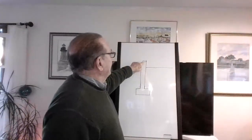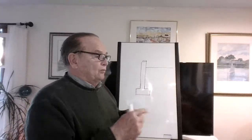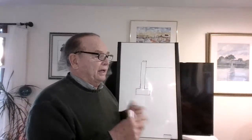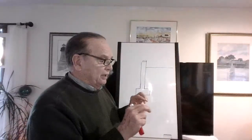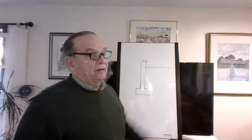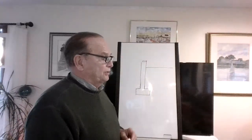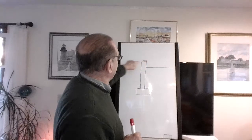Okay, and under it, this I'm sure you're all familiar with. It's called sill seal, SEAL. It's like a cushiony roll of, it's almost like a packing they use to pack stuff so it doesn't get damaged. For those of you not familiar with it, it's foam and it compresses, and it works really good. I remember many years ago, probably when I first started, they didn't have that. And anybody who was working in an old house, you can feel a draft blowing right through here.